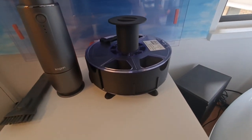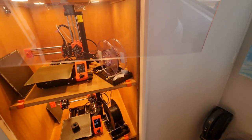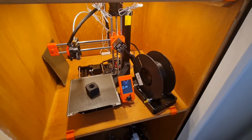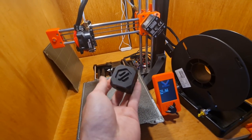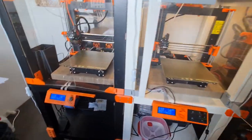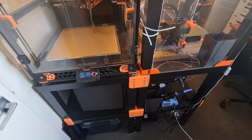Making a filament storage box there. Store all the different screws and stuff you collect over the years. Some little Perspex covers I made with a little holder down there — these just slot on to those clips down there like so, and now it's enclosed. Good for printing ABS. This is the current project: a Mini running Klipper, just tuning it to see how fast we can crank it. They're all just Lack enclosures that I've made, with all these custom brackets to link them together to make it a bit more sturdy. You can see the Voron's also bolted down — stops it from shaking as much. Pretty solid, considering Lack tables are normally pretty shaky, so it really helps to cross-brace them.